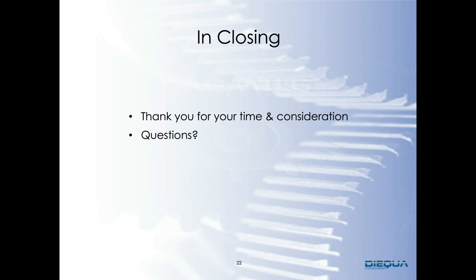The Dynabox has the ability to have modifications to its output. Because it's an aluminum magnesium housing, we have had food grade applications where it became essential to provide an FDA white epoxy to the unit. From a mechanical standpoint, altering the mounting configuration was something we did.